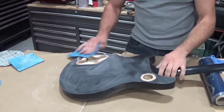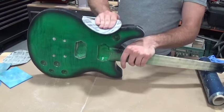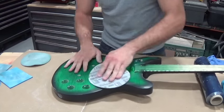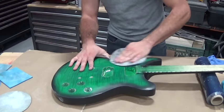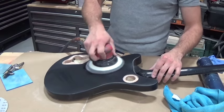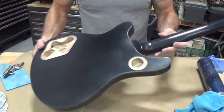I'm finishing it up here and smoothing it out a bit more with seven hundred grit by hand, and then I'll show it to you — it's looking much better, nice and flat. Now I'm moving up to fifteen hundred. You want to get as high as you can basically, so I do the whole thing in fifteen hundred, then I come back in three thousand, and then in five thousand — that's what I'm working with right now. Five thousand grit is quite smooth; it's basically a satin finish when you've got something sanded to five thousand grit, maybe even verging on semi-gloss. I do that all by hand on the front and on the edges, and then on the back I go in with the orbital sander at fifteen hundred, three thousand, and then five thousand grit. When I show you the back here, you can already see it's kind of like a reflection in there — that's without any polishing, that's just straight sanded to five thousand.